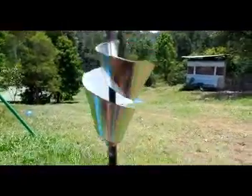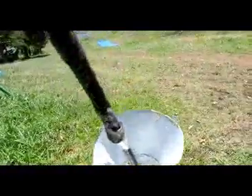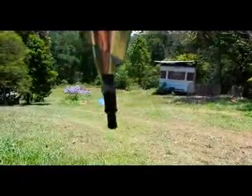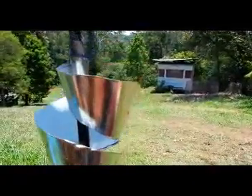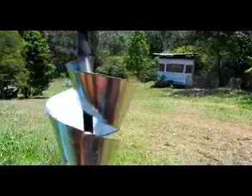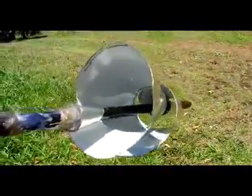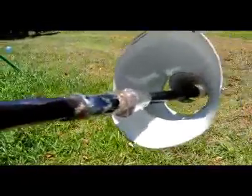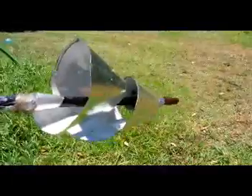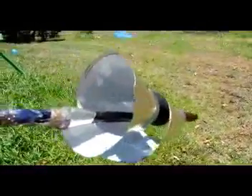There it is — that's what it looks like. And I've found that if you've actually closed the pitch, it was stretched out a lot more than that — it was up here. I've closed it down a bit and now the efficiency has increased. The change in pitch has made it work much faster. It's actually made out of an old malt tin for brewing beer — a nice big tin. I cut it with a pair of scissors, knocked it flat, then cut the crescent moon shape in it and twisted it into this shape.